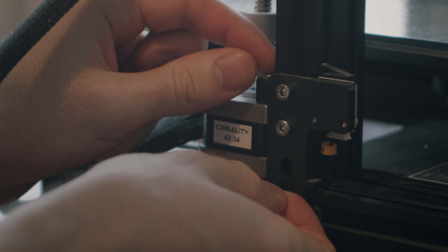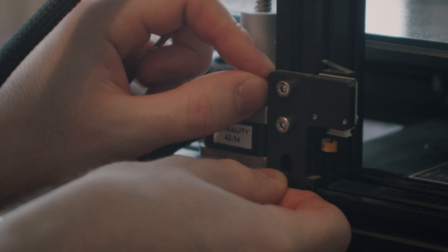If you change filament from PLA to PETG, for example, you will have to change your settings. And even different brands of the same filament might require slightly different settings. So when tweaking settings, you don't want a print to take forever, but at the same time you don't want it full of artifacts so that it falls apart as soon as you use it. So it's all about finding an optimal balance between print quality and print speed. All this to say, 3D printing will require some tinkering — but if you're like me, maybe you don't mind. You'll actually find it quite fun.